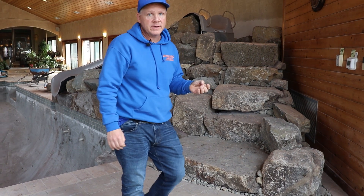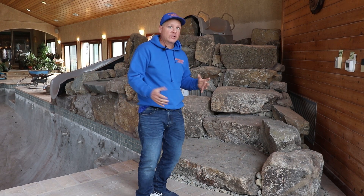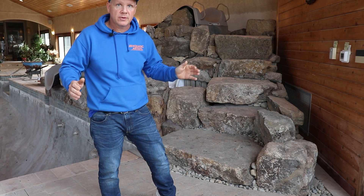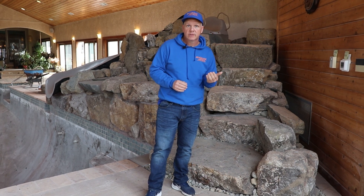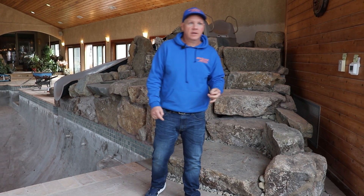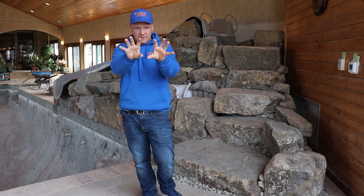It would look very contrived, like they're placed, if it was put on top of the deck. So this is more of a built-in, placed kind of look — a much nicer, cleaner, more natural built-in kind of look. The second thing is we cut the concrete all the way around the entire feature, and what that does is it takes all the pressure off the pool, takes all the pressure off the house. It makes the weight of the water feature independent from everything else around it, because you create a control joint there. So it's got two purposes: one is aesthetic, and one is functional. And I think that's where the art and the science overlap — where the aesthetic and the function meet, where those two circles intersect, that's your sweet spot.